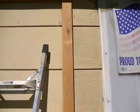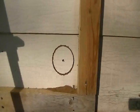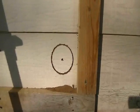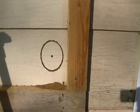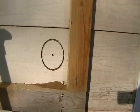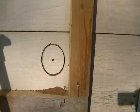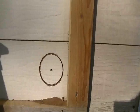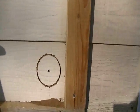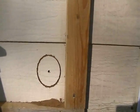I do want to emphasize once again: if you're going to do this project, make sure your local codes, zones, and all that are in order. Lesson learned, YouTuber — charge the battery on your camera regularly; it will quit at the worst time. Here's the start of the hole from the outside. The best thing to do is not drill all the way through, but drill halfway through like I did here, then take a punch and punch right through that center hole to the other side. That gives me a center on the other side to work with instead of trying to get through fiberglass insulation.